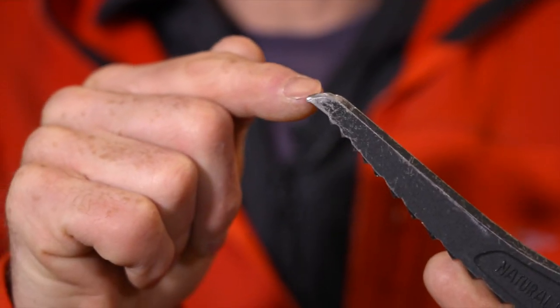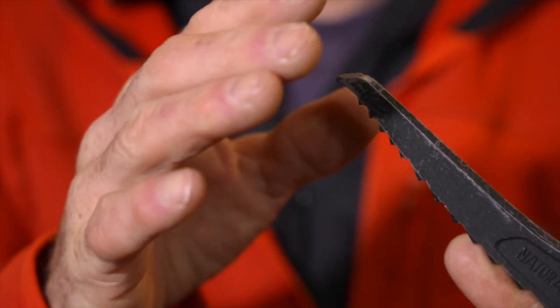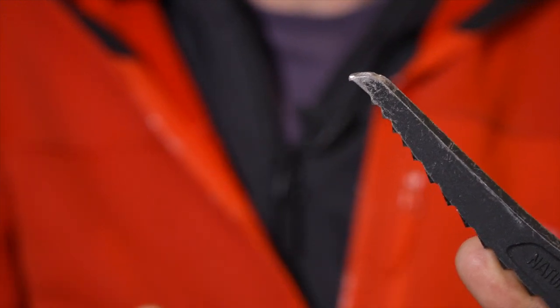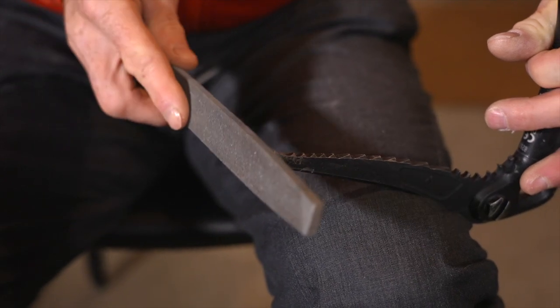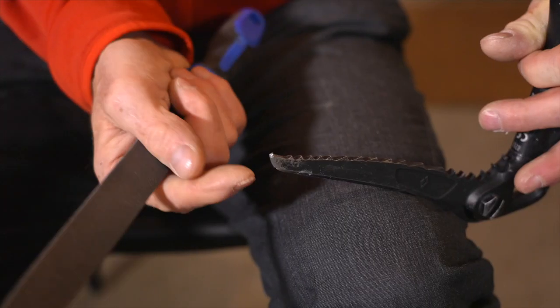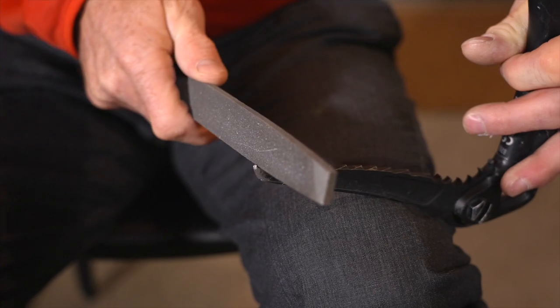You can see all the little burrs along the top of this pick - it's no longer a nice axe shape, it's been beat in and flattened out. There's a big burr right on the tip and I want to get rid of that and restore all of this to factory. If you just file that burr off you're still going to have a problem with the front of the pick, so I'm going to file it off and then move the tip of the pick back to where that burr ends.